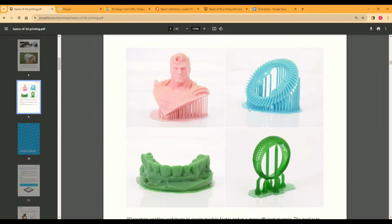So you have a little bit more robustness, and then depending, your materials library does give you some flexibility, maybe for easier flexible prints with certain types of resin, or harder prints. You can mix some resins depending on how you do it, where you can take a more flexible resin and a 4K model resin, something that's meant to print fast, and mix it with like 10% of the more flexible resin. And so you don't have this super rubbery feeling toy or model. It'll actually give some robustness.